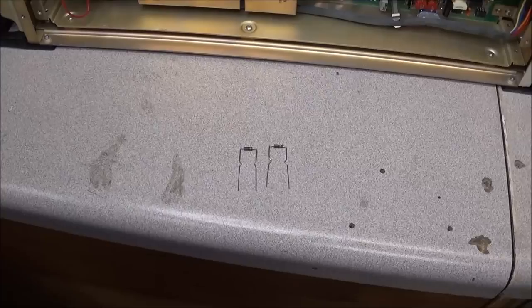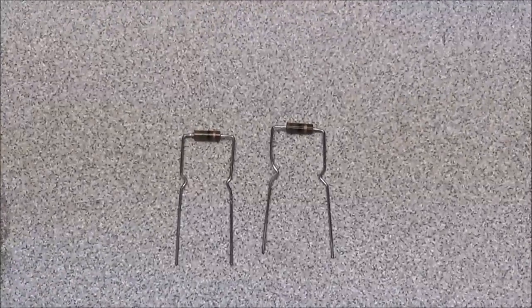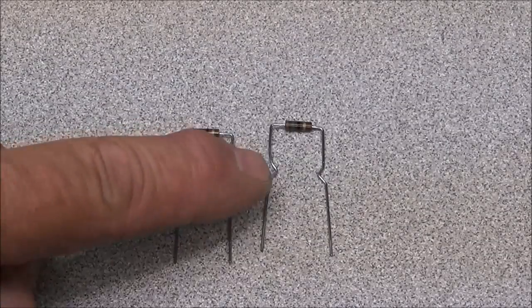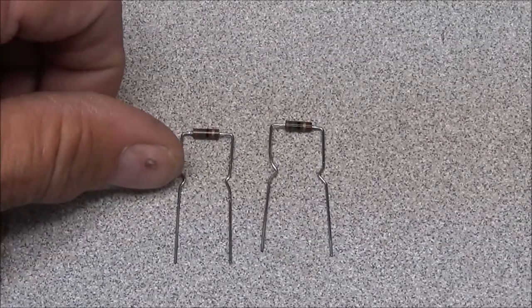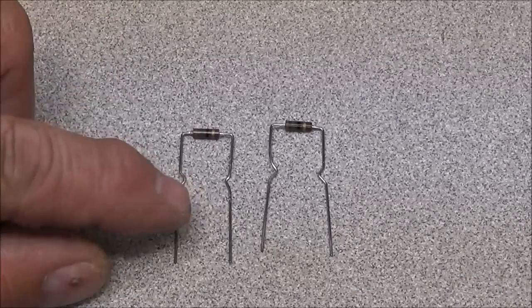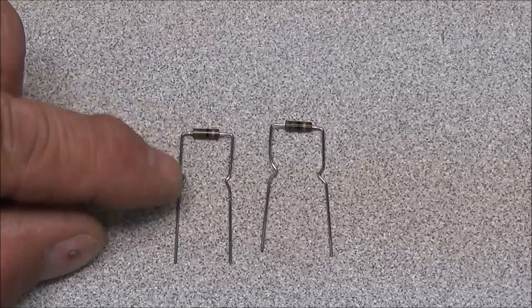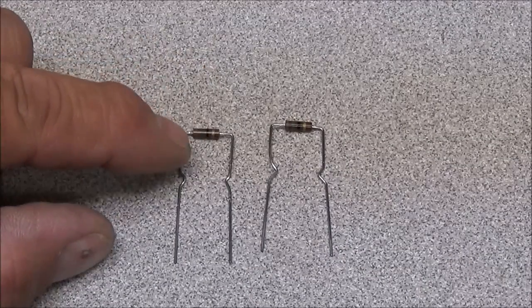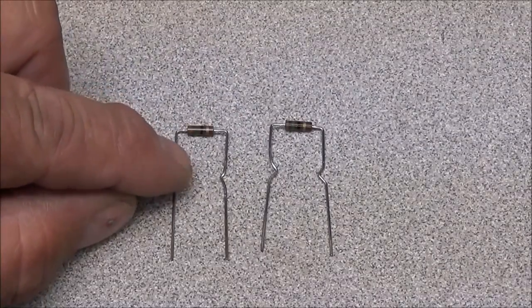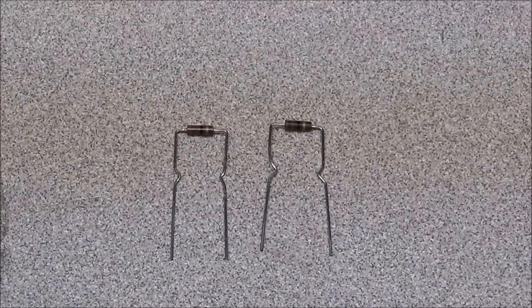So I've got my two new resistors prepared to go in. I decided to leave them up off the board, but I put V-notches in the resistors so the V will sit down on the board and hold from underneath. By doing it this way, if it gets hot and starts to burn, the resistor will not sink down into the board and it'll have a firm spot to hold on to.